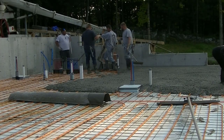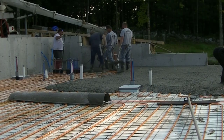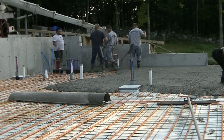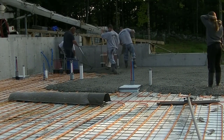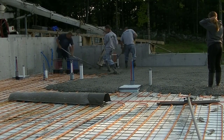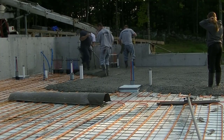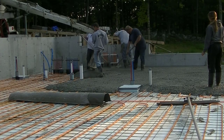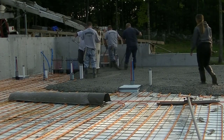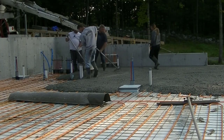There was one little spot in the floor that kind of heaved up a little bit. I guess it didn't really heave up, but there was one little spot in the subgrade that kind of lifted. So when we sawed the contraction joint, we just nicked the tubing with the saw, and we had to cut out a tiny little spot about 1x1 so they could fix that and then replace it. But pouring concrete like this, I don't think I've ever, not that I remember, punctured or damaged the pipe pouring. So you can wheelbarrow on it.